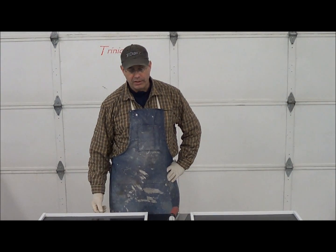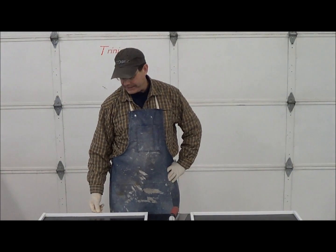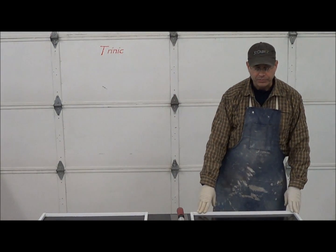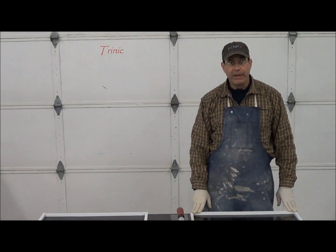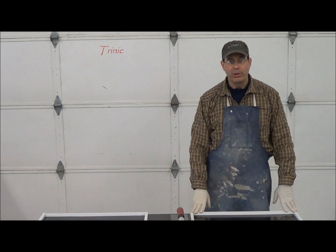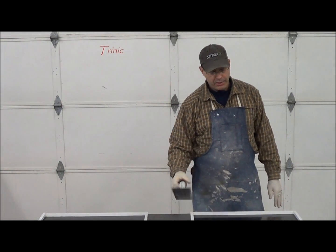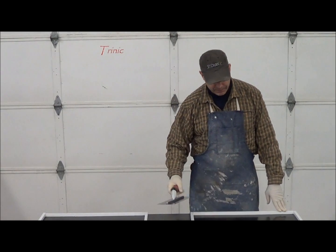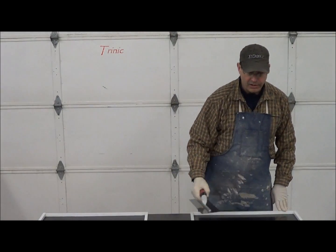These panels are five-eighths of an inch thick. There's some plastic that I bought at Home Depot that uses two-sided tape to hold them down. We're going to mix a face coat with a little bit of black in it to get a darker color so the sealer will show up better. We're going to trowel the face coat into place — it'll be almost self-consolidating, but if you work it just a little bit with a trowel you can get it even.